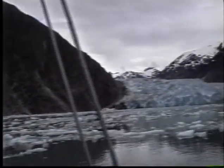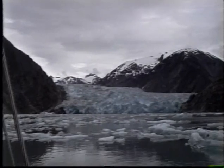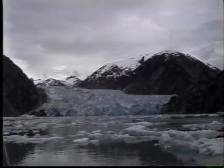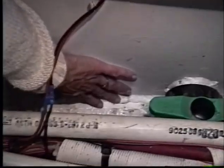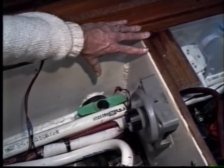Between those bulkheads, Sundeer's bottom is almost totally made up of fuel and water tanks. This gives her, in effect, a double bottom, another safety feature. You can see here how the tank side is welded to the hull. The keel is welded too, so there are no keel bolts to leak. These massive aluminum floors spread the load of the keel when we're aground or during impact.